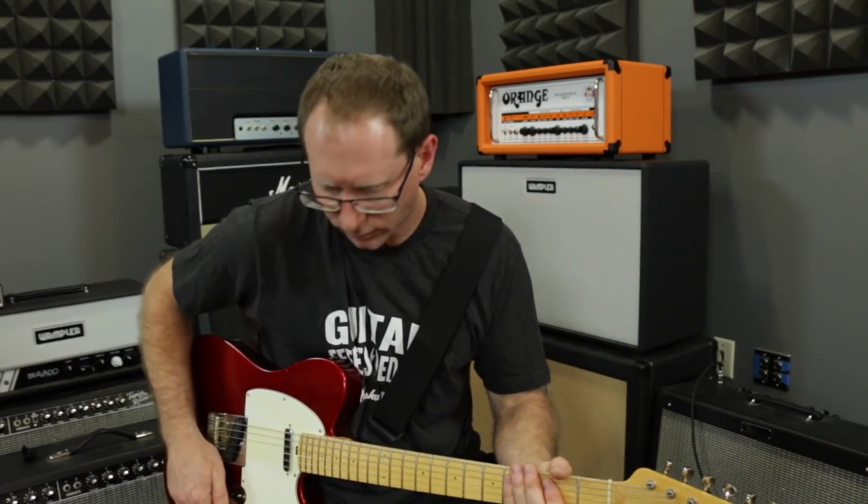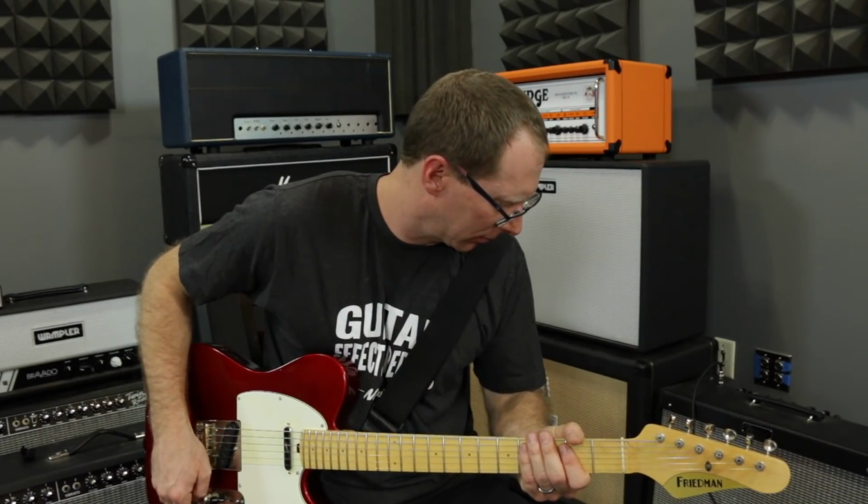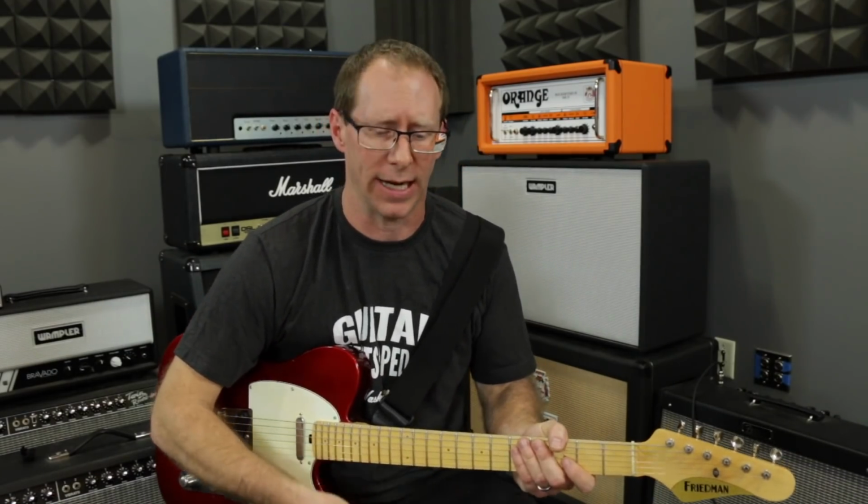And also, if you listen, you'll hear a hiss in the background. That's normal for any high gain device, anything that's adding gain, because whatever noise is present in your signal chain, in this instance I have fluorescent lights around me, and some nasty electricity in a barn, basically, with the room built inside of it. So there's going to be some noise in here. That's just amplifying whatever noise is present in the chain. It's something you're always going to have to kind of deal with whenever you're using gain pedals. Or really, an amp with gain in it. Same thing if you're using an amp with gain in it. Any noise there gets amplified.